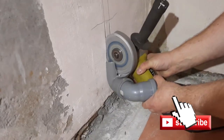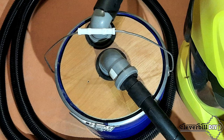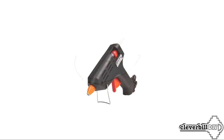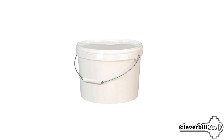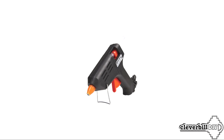Don't forget to subscribe to my channel. And so, while making a new cyclone, I still decided to share this not tricky process with you. Based on previous experience, I immediately ruled out using a plastic bucket and using a glue gun for joints, since a bucket made of thin plastic is not reliable — it collapses from a vacuum, cracks, and it is inconvenient to put a lid on it, and the glue from the glue gun does not hold the pipes well as they loosen over time.